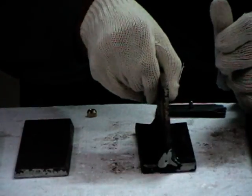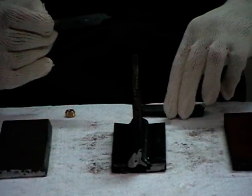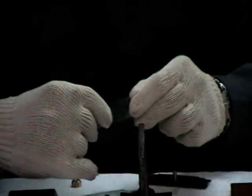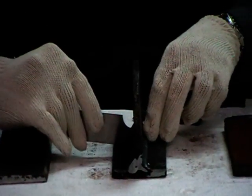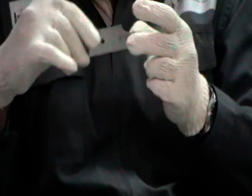Now let us see how the concave fillet can be measured using this particular gauge. We don't know the weld size. We assume by looking at the weld that it should be a 7.9mm weld. So we select this particular gauge and use the concave side of the fillet gauge to measure the weld size. No, this is not fitting — this weld is more than 7.9mm. So let's take the 12.7mm gauge and see whether it fits the requirement. Just precisely, this is the gauge which fits the requirement. So we can declare this particular fillet is of 12.7mm size.